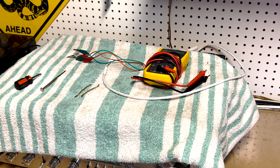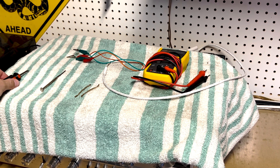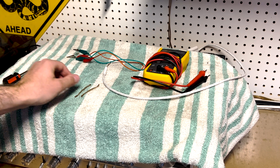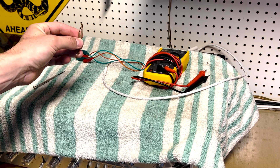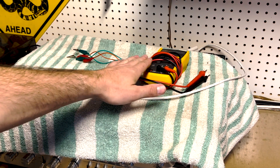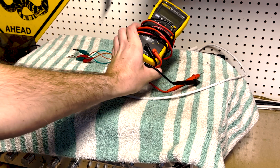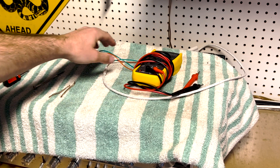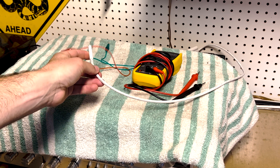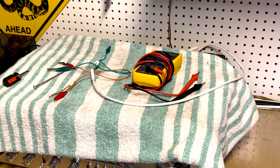The tools required for this service are pretty simple. You just need a Phillips screwdriver to remove the bonnet and the grill, a small flathead screwdriver to adjust your VRs, two speaker-wired jumper wires to hook up to the speaker outputs so you can connect your meter while adjusting the wattage needles. You will need your multimeter, some jumper alligator clips, and an RCA to headphone jack adapter so you can play a signal through the unit. And that is basically it.